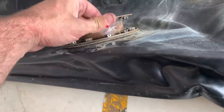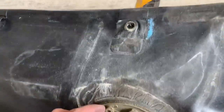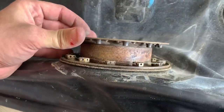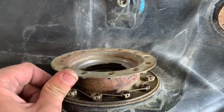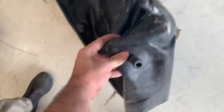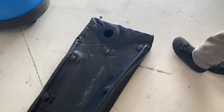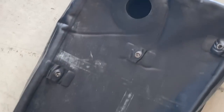That right there is where it was leaking — that seal is done for. You can see it leaked there, went over that edge, and there are little blue crystals from the fuel where it's been leaking. So there's your leak right there. These are probably all not tight — that's probably why it was leaking. Also, a lot of rust on this from all the fuel vapors. I've got four hoses and three interconnects. Getting that one out was awful — I have no leverage, I have short arms.